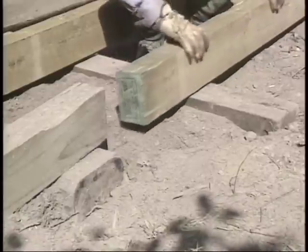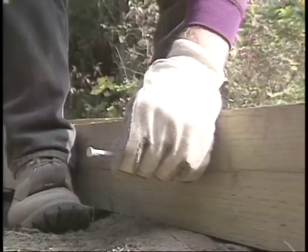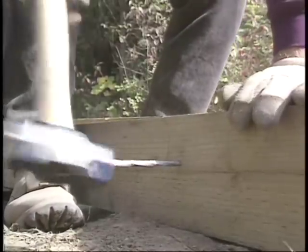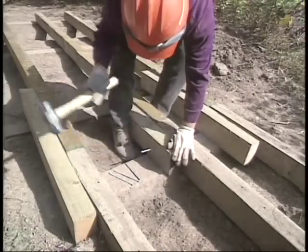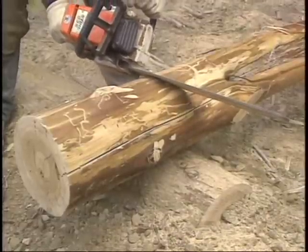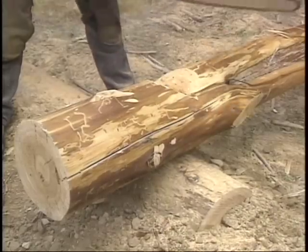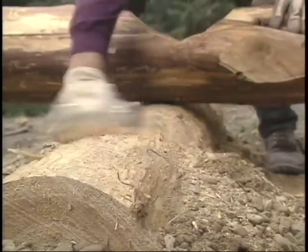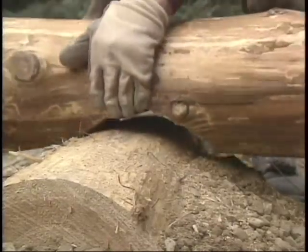Make sure that a mud sill is placed on each side of a joint under the stringers. These 2 mud sills should not be more than 2 feet apart. Nail a tie stringer to the double mud sill. If logs are used, notch the underside of the stringers where they lay on the mud sills. This stabilizes and levels the stringers. Do not notch the mud sill because notching allows water to penetrate and rot the sill.